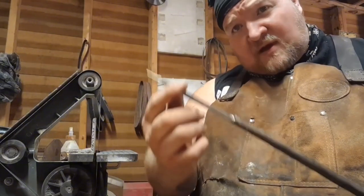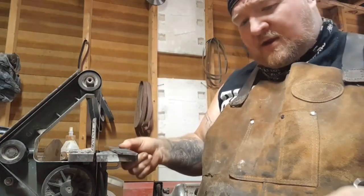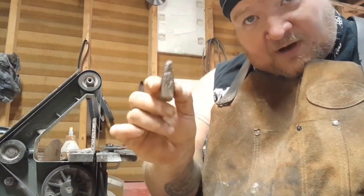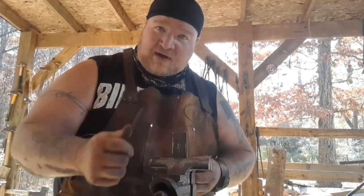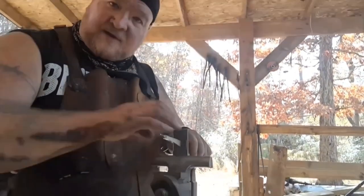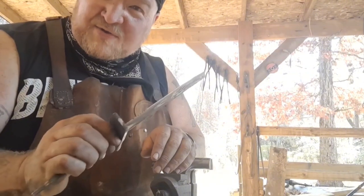One quick trip outside to the angle grinder — we've shortened up the tang just a little bit, got it nice and rounded and ready for tapping. Got some more work to do on the blade but we'll get there. Got a hand guard piece cut, butt cap piece cut, and a piece of railroad spike cut for our butt spike. The hand guard is drilled; now we're just taking a file to clean up the holes and get it slotted up so the knife fits through. And that fits neatly in there — that's our hand guard, and next we're going to shape it into something really cool.